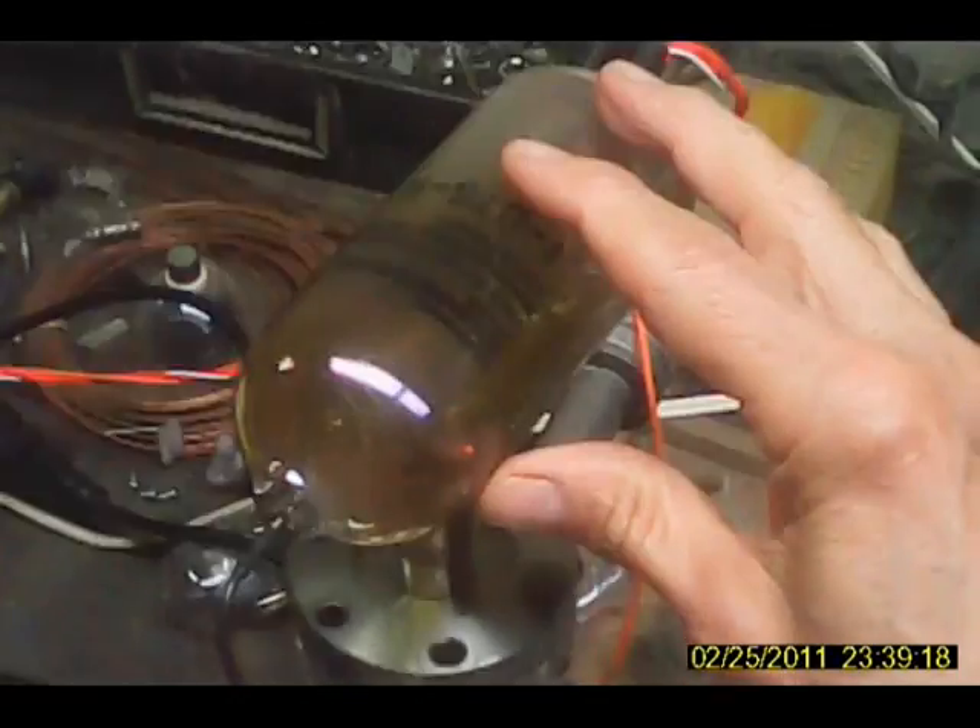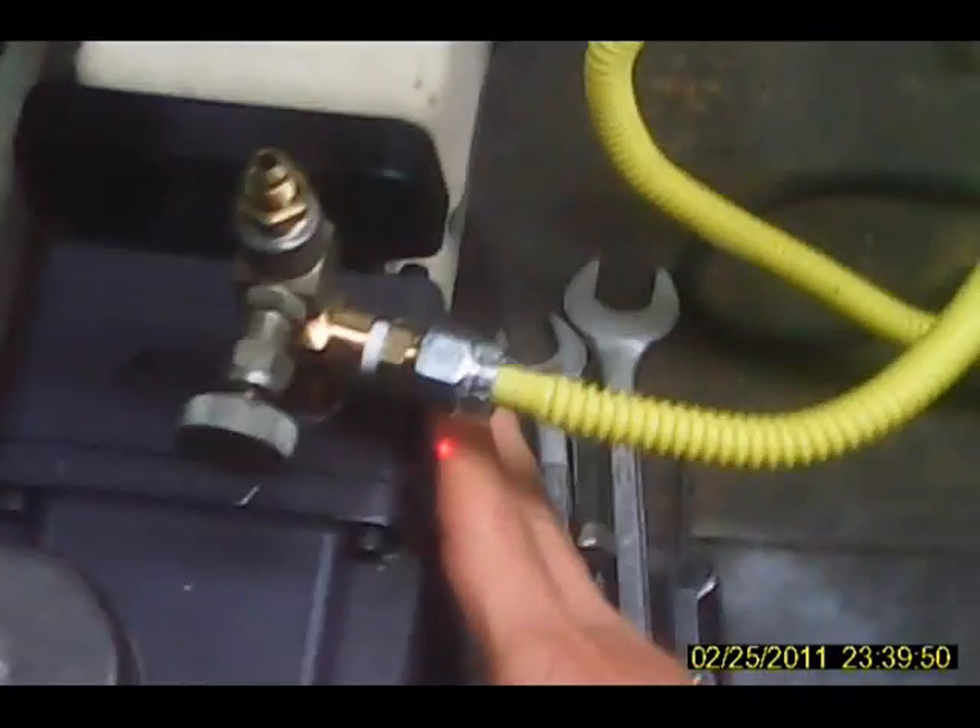We have a convection gauge for measuring the roughing pressure, and a high vacuum gauge — this ion gauge tube — for measuring the ultimate vacuum. This top piece is just an adapter, a piece of tubing with flanges on it. This is the readout for the convection gauge, and we have a valve which cuts off the backing pressure going to our roughing pump — a little two-stage three cubic foot per minute unit. This is the controller for the turbo pump; it's newly repaired, so we'll find out if it works. And this is the ion gauge readout.